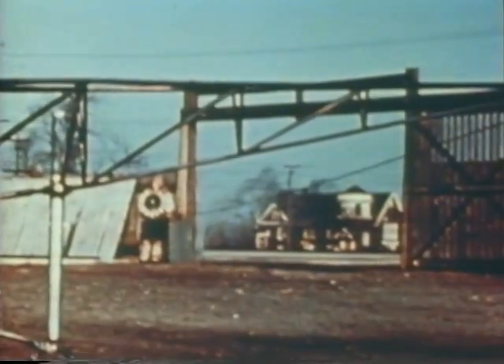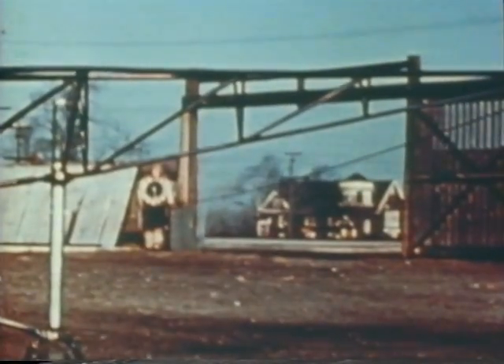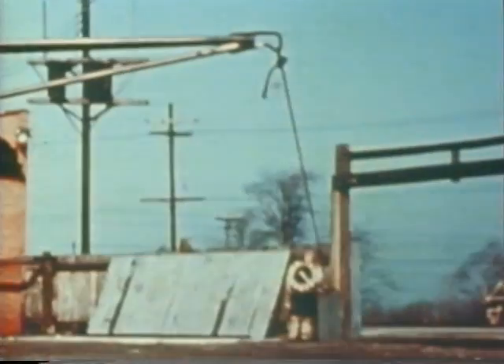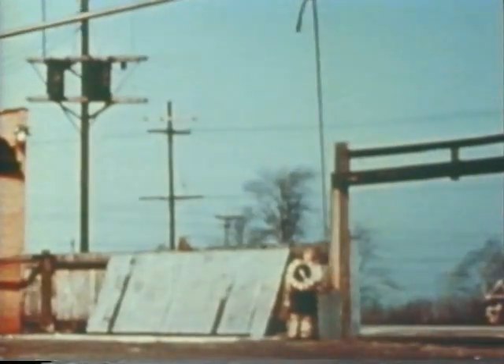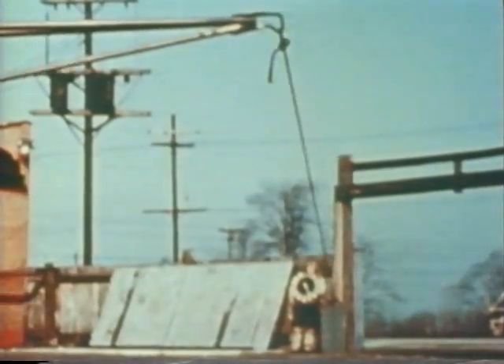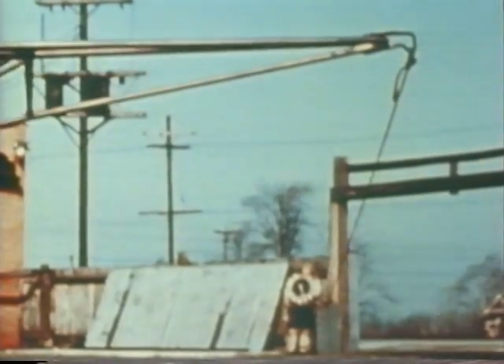There you can see the method of measuring the torque. Since we know the force and hence the torque, and we know the RPM, we therefore know the power very exactly. The engine is 165 horsepower, six-cylinder opposed Franklin. And much to their embarrassment, we were always able to check up on the power output of the engine.